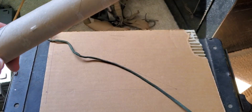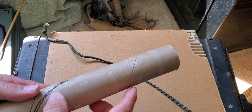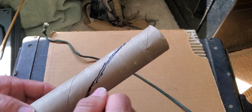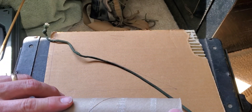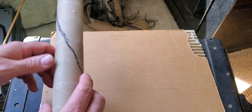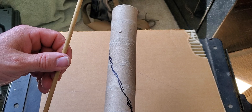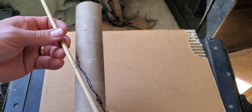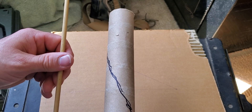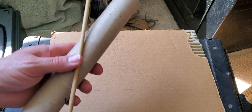What we take - it's wood - we could take a rat tail file and start cutting this groove in here, getting it a little deeper, deeper, deeper, along our line. And once we've got it so far, we're going to take that file - whatever diameter file we're going to use - we want to try to use a diameter matching a piece of round stock we have. Because once we cut that groove, we're going to lay that round stock in that groove.